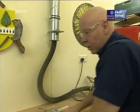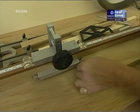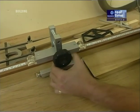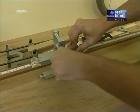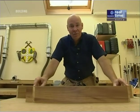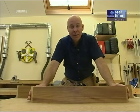With that board held in place and not moving it at all, I'm going to slide my stop up underneath it. I can't use the gauge on the stop because the saw is tilted over to 45 degrees. By bringing this up and holding it in place, it'll give me a reference point so that when I cut the second rail, it'll be exactly the same length as this one. You know you're going to have a perfect square if these angles are 45 degrees and each pair of boards is cut at exactly the same length.